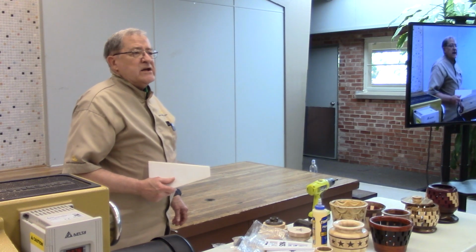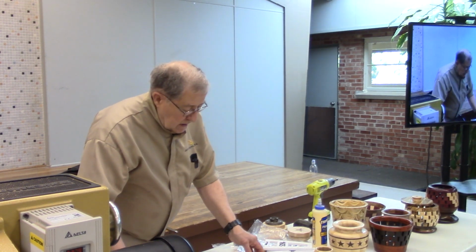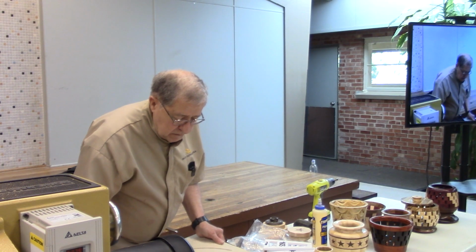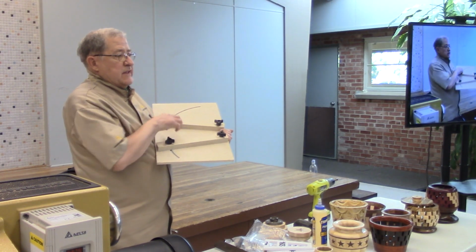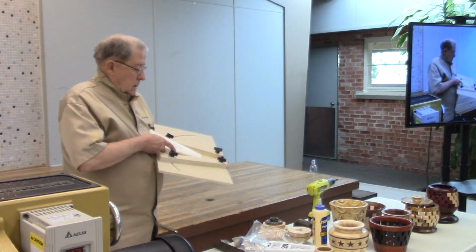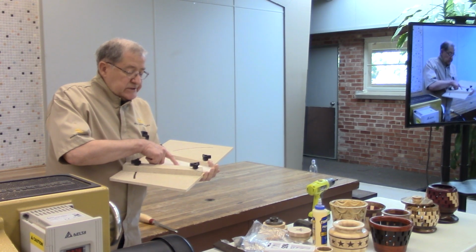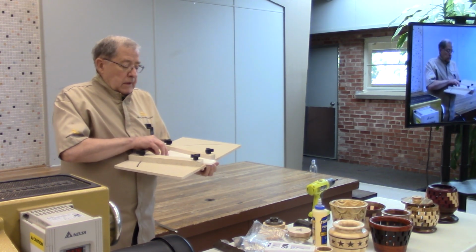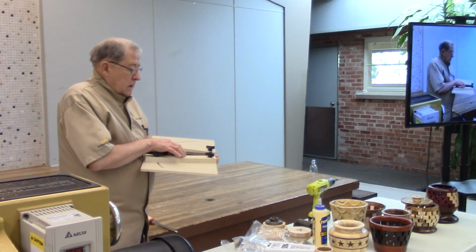Does everybody know how to make a wedge? You can make them on a miter saw, any number of ways, but I had a member that made this for me, where you can loosen these and form an angle you want, and Michael can make the different segments. This is a 16 segment, it's 22.5 degrees, and you center it and then tighten it down real secure, and then you can put a piece of wood in,